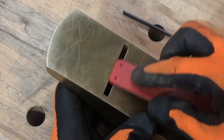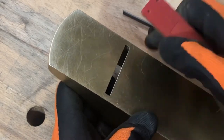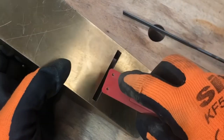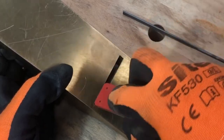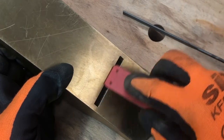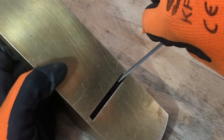Here I'm just doing some work on the long edges of the mouth. If you get scratches or even burrs on your long edges, that can transfer to your work, so this is an important task. I could feel some scratches, so I thought I'd go in with the diamond file on the long edges and make sure I've got that nice and smooth. And for the short edges, I used the edge of the slim file.